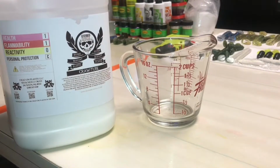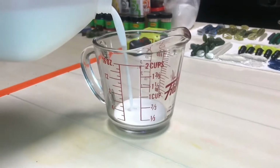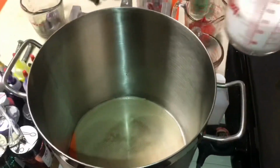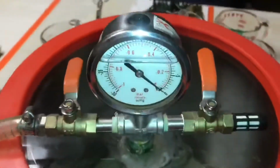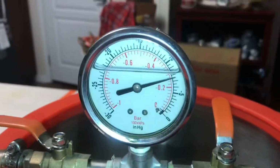Now, it's a relatively simple process. It starts off with a product called Plastisol, which is essentially a liquid form of plastic with different resins and hardening agents in it that needs to be cooked to a certain temperature before it will harden and cure to the final product. So we're going to start off by putting a cup of that Plastisol into our vacuum chamber, which helps us eliminate the chance of there being any excess moisture or air getting into our blend.